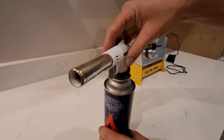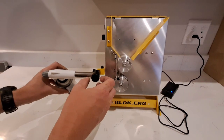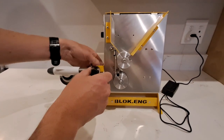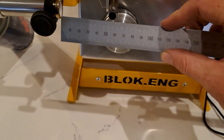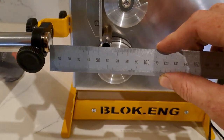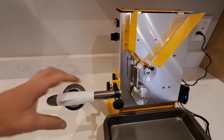The gas burner is attached to a 220-gram gas bottle by aligning it with the cutout on the gas bottle top and rotating it clockwise. The hottest part of the gas flame is where complete combustion occurs at the tip of the inner blue cone of the flame. It is best to space your gas burner nozzle about 50 to 55 millimeters from the case mouth, where this tip of the cone occurs.